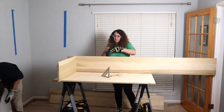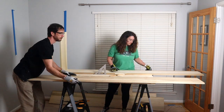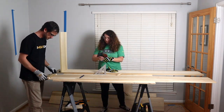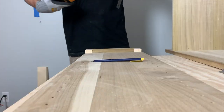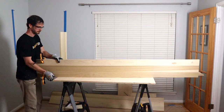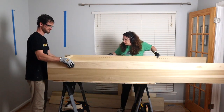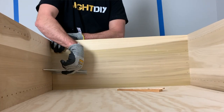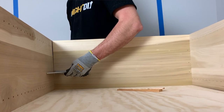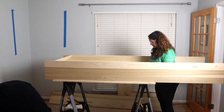Since we had five more sideboards to go, we made a measuring guide for the bracket height. We replace it using 2x4s as guides to make sure the frame had the room it needed, clamp it down, and nail it. We bring the two halves together, measure for 90 degrees — and measure again because someone moved it — and nail it.